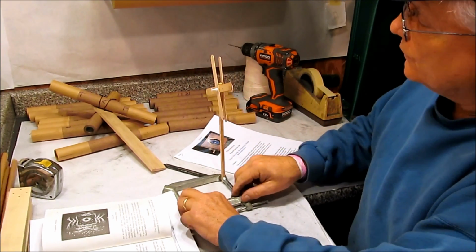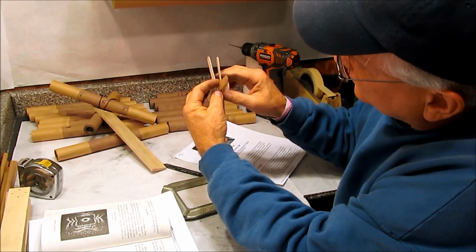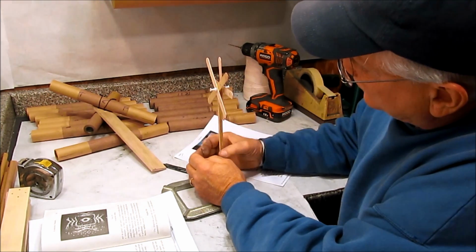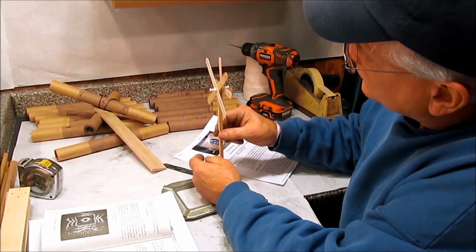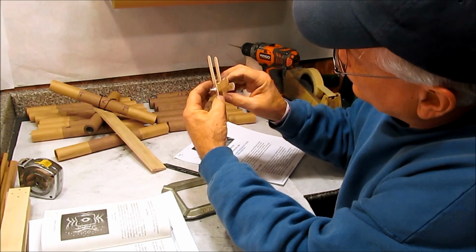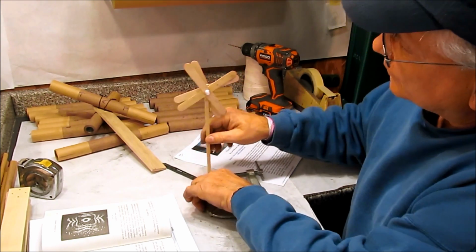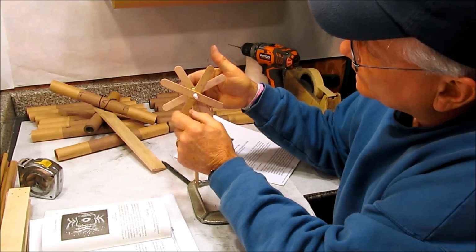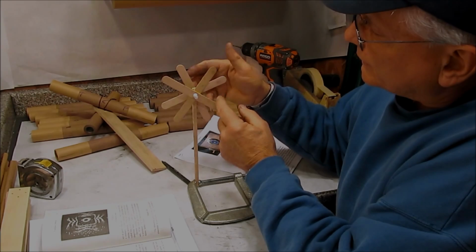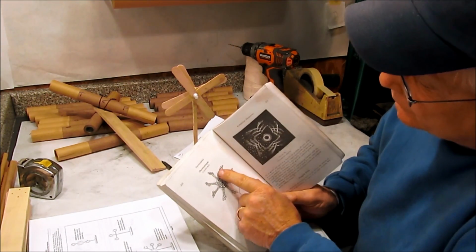You can see that it's going to be necessary to create a support that separates the wheels somewhat so they don't bonk into each other and stall each other. I'll be building a support that's built out of two 2x4s screwed together, mounted to a fence post. I'm going to put some guy wires on it to keep it from wobbling. I will use the kind of spacer blocks behind the wheels that I used in the other wheel project. So the wheels are actually going to be separated by practically a foot of distance. But when viewed from the front, the effect of both of them will merge together, and that separation will not be noticeable at all.